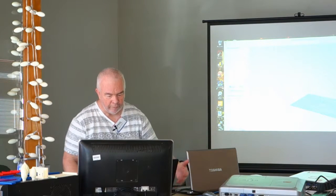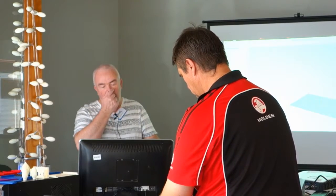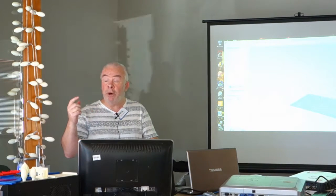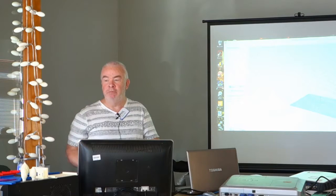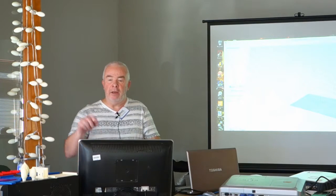Does the machine have consumable parts? Yes. It's a mechanical machine. Like all mechanical machines, there will be wear and tear. Okay. I've had a number of issues with mine, remembering that I've got over 1,600 printing hours on mine. I replaced the nozzles themselves. I didn't have to, it turned out. There's some plastic tube inside which should be replaced probably every 1,000 hours worth of printing. Pretty easy to do. Spanner under the nozzle, stick your tube in. I had one of the wires break for one of the heat sensors because it's solid wire on a moving platform. It's going to break. So there are a couple of things, but in general... Were any of those bits expensive?